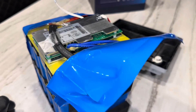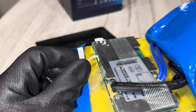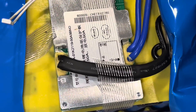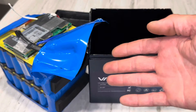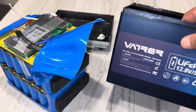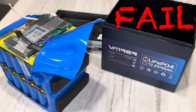I'll give you another shot to be fully investigative. There's no thermal switch on the BMS itself — this is protection for the entire battery, high temp only. You can see that's a 75°C thermal switch, not a temperature sensor. Sensor pinouts would be in this area right here; this BMS is not configured that way. So I'm stopping testing because the advertisement is false. The manufacturer claims low temp protection — low temp cut protection, charge and discharge — but that is a high temp thermal switch. When I find that the manufacturer is making false statements, I cease all testing. Because they're lying to you right off the bat. How can you trust them? How can you trust anything else with the company?